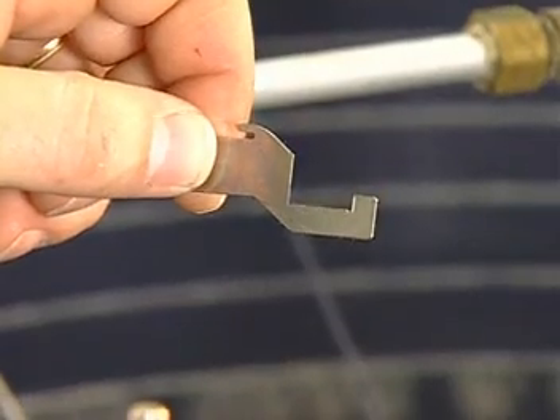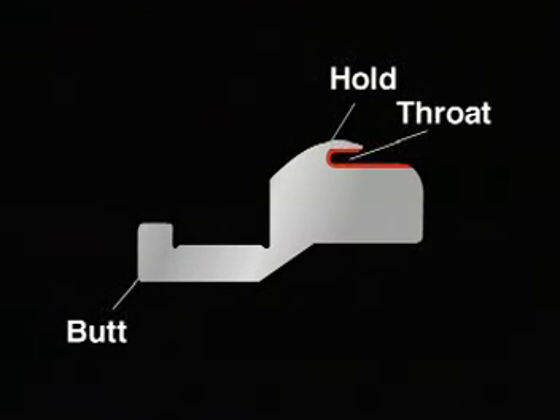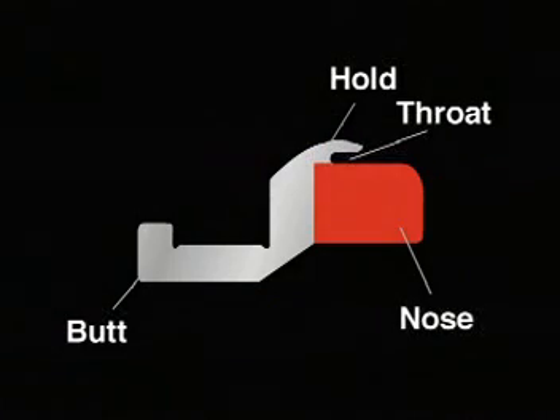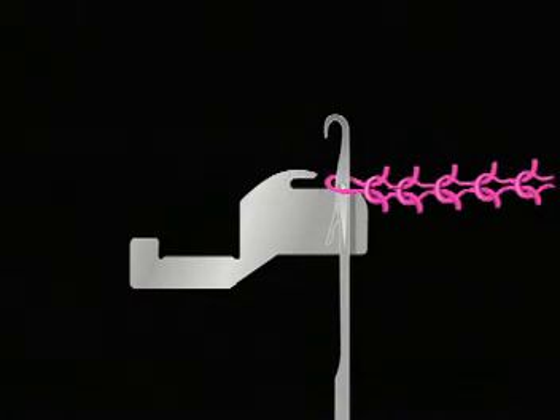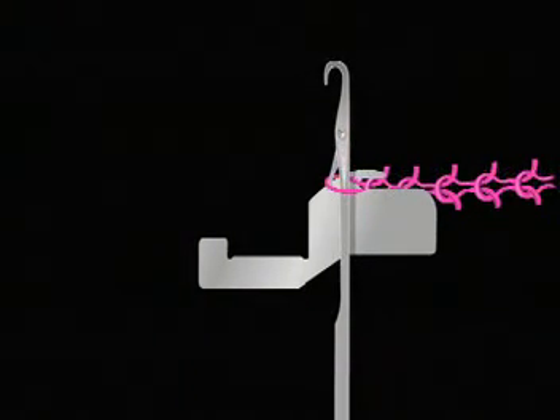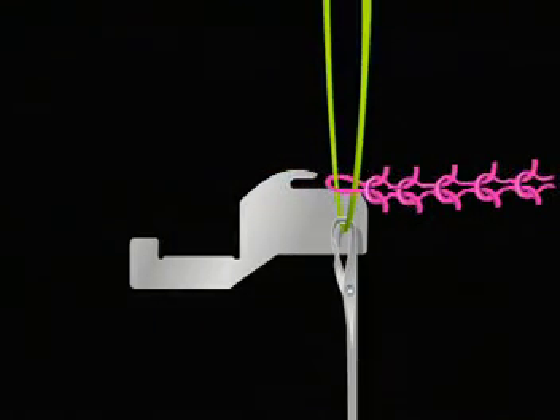The sinker is a thin steel element with a distinctive shape. It has a butt with a place to insert a cam, a hold, a throat, and a nose. As the needle goes up, the sinker moves in to catch the fabric in its throat. Since the fabric can't go up with the rising needle, the old loop now clears the latch. When the hook catches a feeder yarn as the needle moves down, the sinker moves back out of the way, and knock over, cast off, and stitch forming takes place. As the new stitch is formed, the fabric rests on the top of the nose.